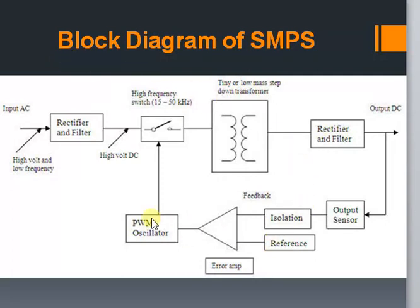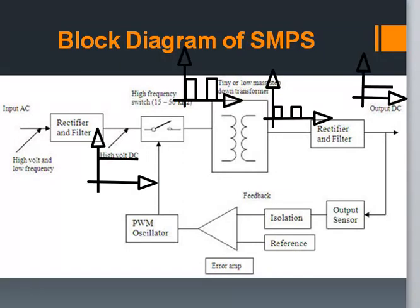So this is the block diagram of an SMPS. As we can see, the first block takes the AC mains and converts it into a DC signal. Following it is the chopper with typical frequencies of 25 to 50 kHz. This frequency is set above the human audible range to avoid audible noise. It produces a DC pulsating wave. These are the waveforms at its different stages. The transformer now steps down the pulsating DC signal and it is applied to the output rectifying and filter circuit to get a constant DC output like this.